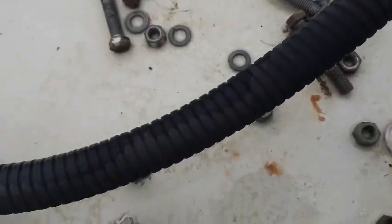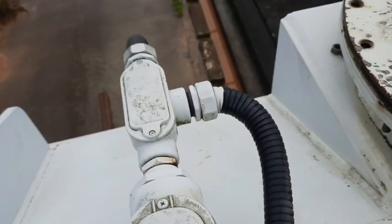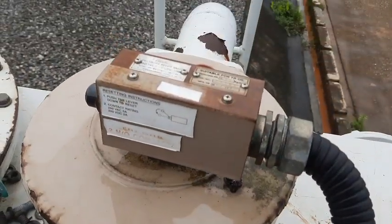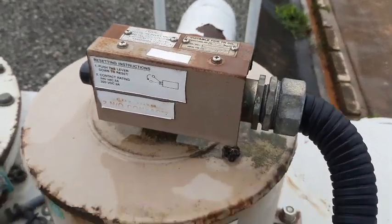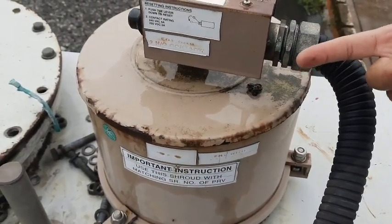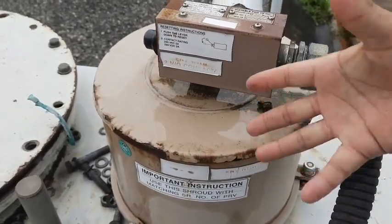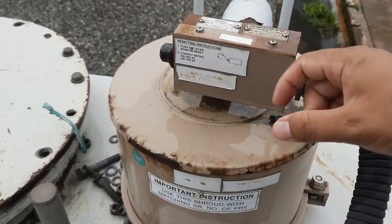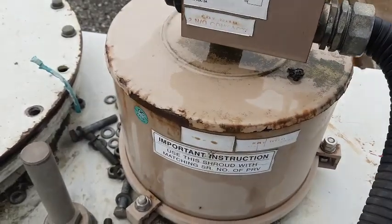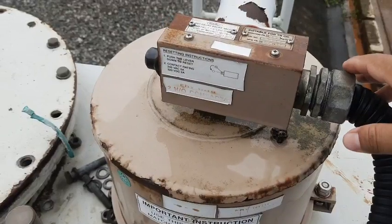This is the connection — the wire which is taken to the cooler control cubicle. I'll be opening this from the rain guard just to see how it looks inside. This is the dome. The construction may differ from company to company, but in this case — used in this reactor — it looks like this. In a transformer it may look like a dome or conical shape. The shape varies from transformer to transformer.